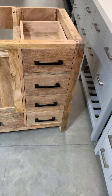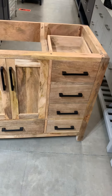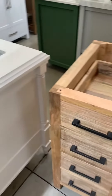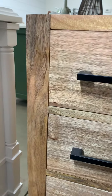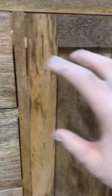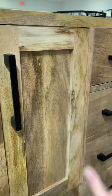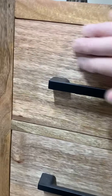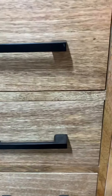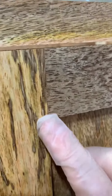Another topic is the finish of a cabinet. It's all natural finish, clear lacquer. We need to make sure all finishes are applied evenly — no blemishes, no wet spots or dry spots. It has to be all even and smooth to the touch, super smooth. No rough edges like this one right here — you can see it was oversprayed. This is no good.